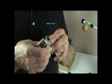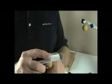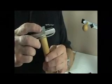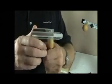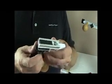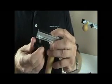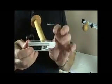On the bottom, you can see it's an aluminum extrusion. Everything's mounted into that aluminum extrusion, including the captivated bolt. As we screw on that dowel, you can see it's connected to that hex head bolt. As you tighten it, it can't come loose, and it can't go anywhere. Protected by the hex head fastener. This black material here is the brake. You can't see it very well there, but as you adjust the knob down, you're pushing that brake against the inside portion of the aluminum extrusion that this fits into.